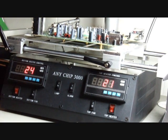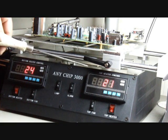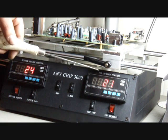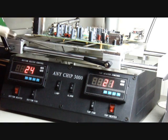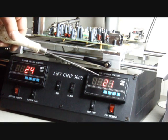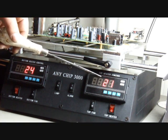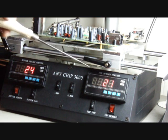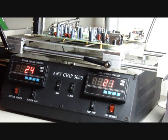The board is replaced on the machine. Settings: bottom heating temperature is set to max out at 185 Celsius. I have the top temperature set a little bit higher because I don't want to keep changing the temperature back and forth if I am going to remove a chip. The alarm is set to go off at 220 Celsius, which is the area I really want to start watching to do the reflow correctly.